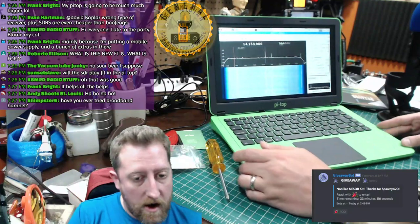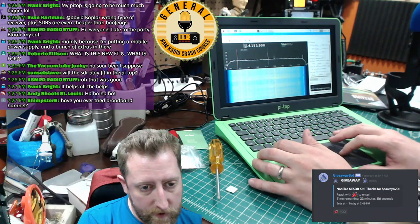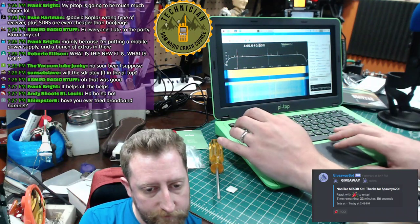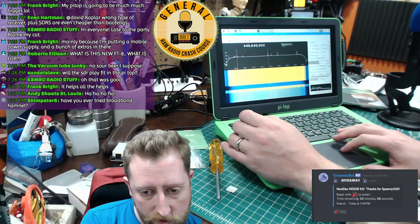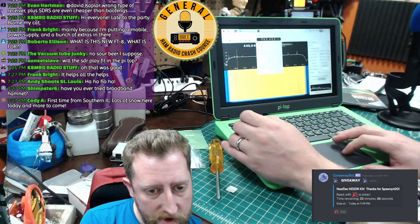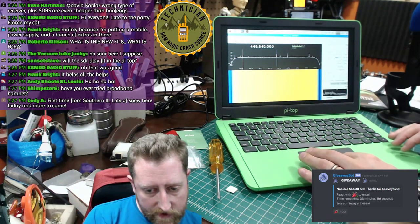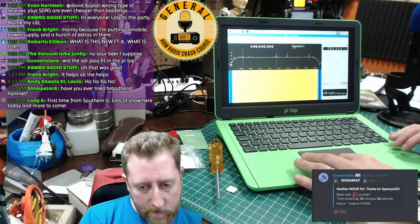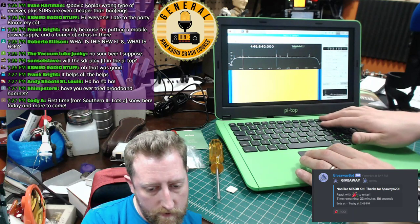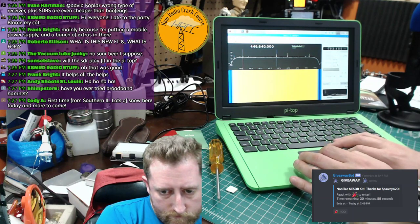Let's go ahead and mute that for a second. All right, so for the heck of it, let's change frequency. Let's go to 446.640. And we'll change this to receiver options. Why are you not where you should be? Get back over there. Yeah, I'm going to remote into this in a second because this is getting even hard for me to operate. So we don't want upper sideband. We want narrow FM. And, oh, come on. There it is.